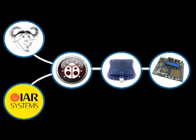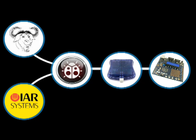Let's have a look at the tools lineup. You can go with either the IAR Embedded Workbench for AVR32, and we are also launching AVR32 Studio, which integrates with both IAR and GCC compilers. GCC is already ready, and the installer of AVR32 Studio will install the GCC toolchain for you — AVR32 Studio can already be downloaded from the web. For debugging, we recommend using the JTAG ICE Mark II. For programming, you can also use the AVR ISP.